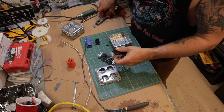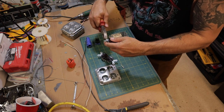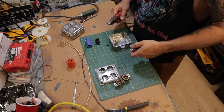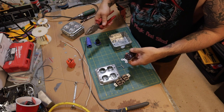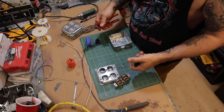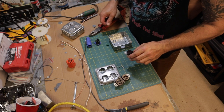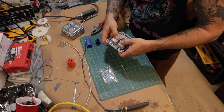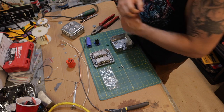If you get these more residential-type outlet receptacles, you're going to need to pop these little tabs off the end. Now let's get technical for a moment — I'm going to make this cable out of some 14-3 that I had lying around. You can also make this with 12 gauge if you're using this for amp back lines. For your band, 14-3 cable is probably going to be more than enough — even you and a bass player, you and a guitar player, whatever. I'd advise carrying a couple of these, but two or three drops for a normal back line, even if you're pulling an SVT and an old Marshall or something like that, it's not going to pull over 15 amps. If you start going over 50 feet with your cable, then I would definitely suggest going up to 12 gauge, but in most situations you shouldn't need more than that.